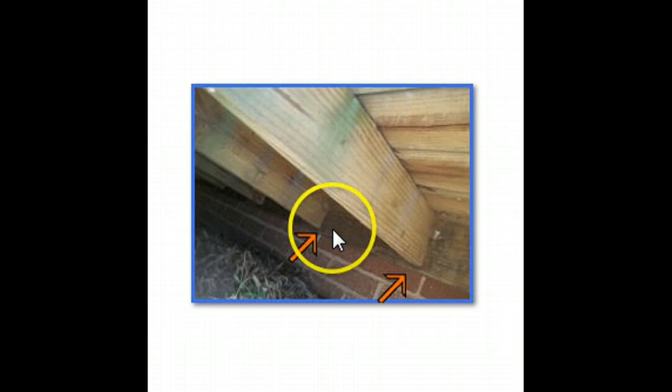It's crazy. So all these joists should have a ledger board that they're hanging on that's supported, that's nailed to the rear joist here, or hangers, which also give a lot more support. So all joists should have hangers or ledger board on a deck.